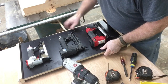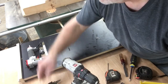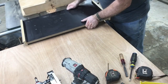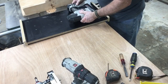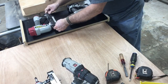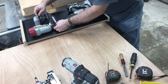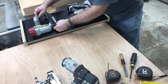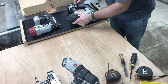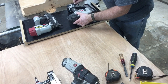Now that the first three are in position, I'll take them off, flip the board over, and mount the remaining two nail guns on the other side. I'm resting the board between the outfeed table and the table saw so I don't have to remove the screws. I place the two nail guns in the approximate locations, mark with a pencil, drill the pilot holes, and put the screws into position. Pretty simple process.